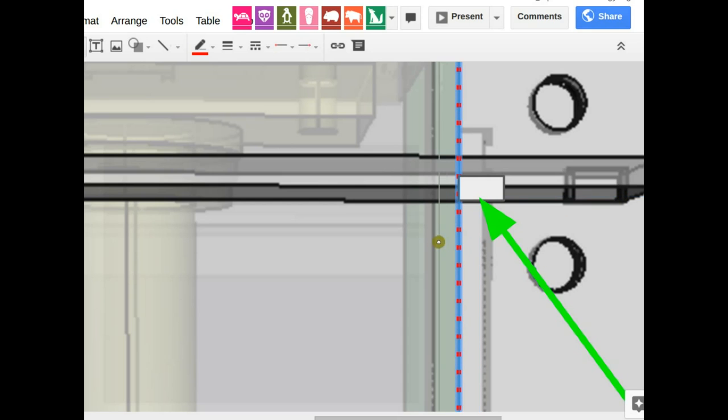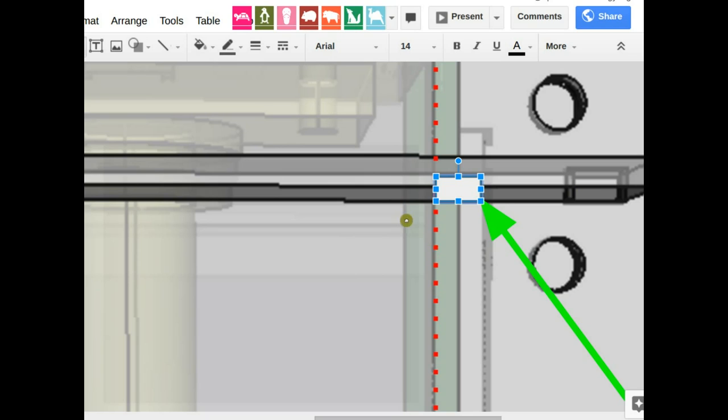Yeah, it could be inner, as long as it's not going past it. So maybe do that, because the only consideration there is don't make that tab go into the chamber itself, which starts at the red line. So the face is smooth. Yeah, we're going to weld it and then grind it smooth. Okay. I'll shift that to the inside then. Yep. Okay, that's good. Thank you.